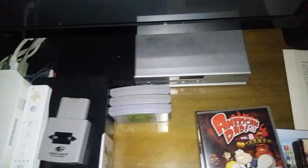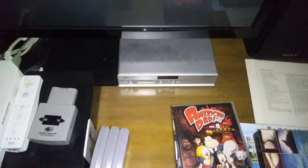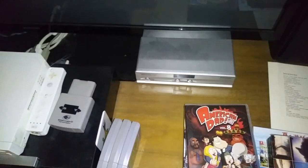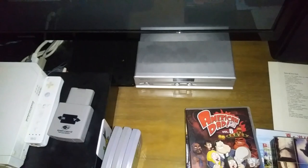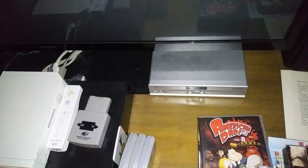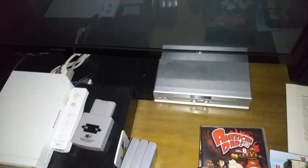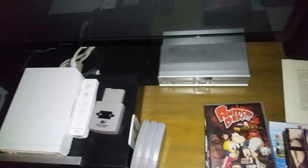Anyways, and then over here on this side, I've had this for a little bit longer. This is my component switcher, and it is a 4x2, which is more like it. This is still a matrix switcher, though. Both of these are. There's no reason for that for my setup. I could just as easily have a routing switcher, because whatever input I'm viewing on the screen is going to be the same one as I want to get on the capture card or whatever external device I'm sending it to. So ideally I would have a 4x2 or 5x2 component routing switcher, and same for composite,